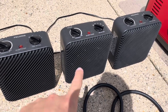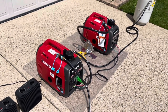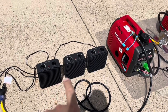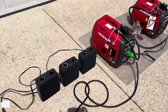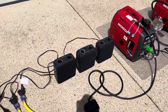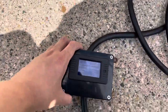The generator will obviously handle two loads because together, the surge wattage on the two EU2200s connected together is going to be 4,400 watts surge, and running wattage will be 3,600 running watts. So these two heaters together will be 3,000 watts, and that'll give us our final push and max load reading to see if it handles a third heater. Ideally, you don't want to go over 3,000 watts. But we're going to turn on the third one and see what happens. So we're going to go ahead and turn on the first load.